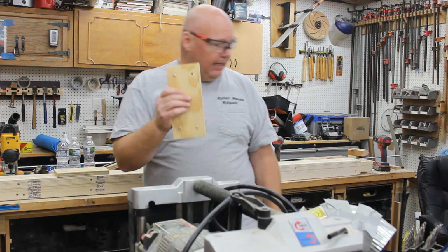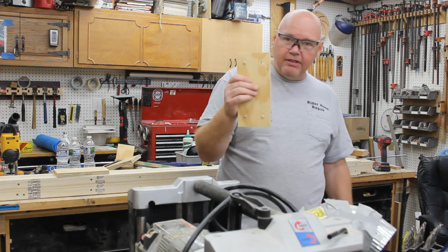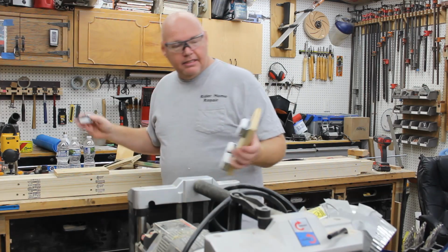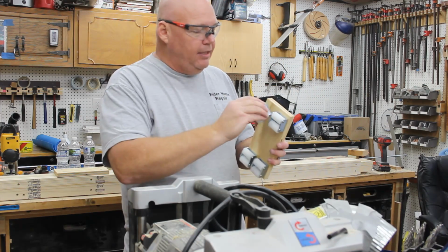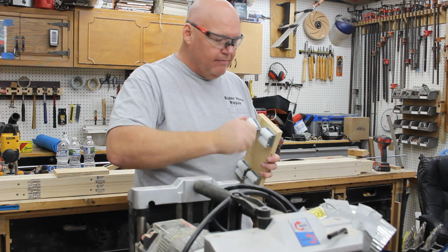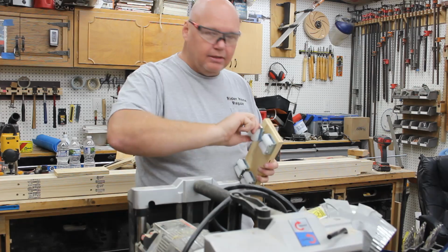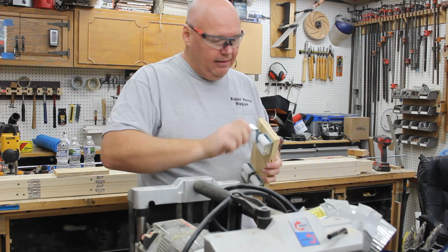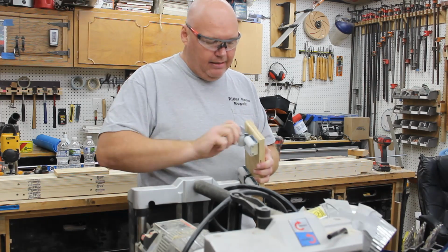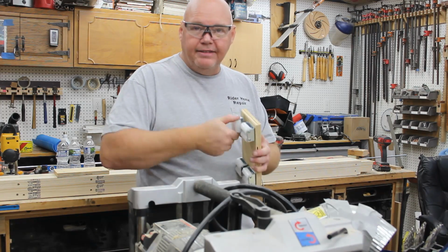And then you want to drill a 19/64 hole, and what that'll let you do is screw this into the wood so that you don't have to worry about any rattling or loose bolts. It's nice and quiet. And so you just thread this in, and then it'll cut its own threads, no big deal.